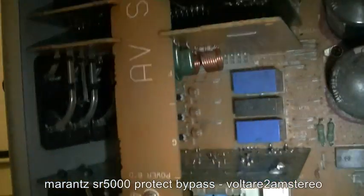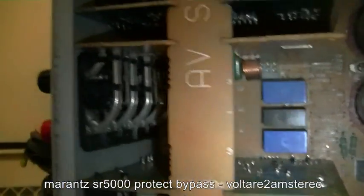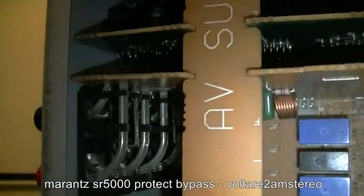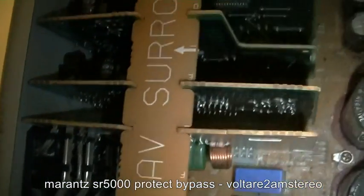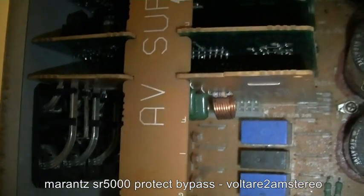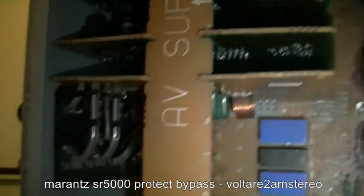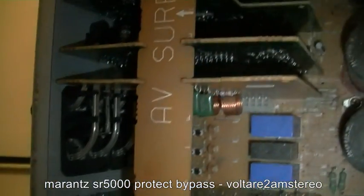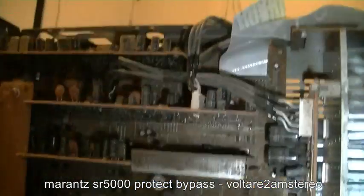Oddly enough, with this amplifier's design, the black terminals for all the speakers actually go straight to ground. They're not BTL'd off the back of a pair of amp chips or anything like that. It's being run basically, I think, you wouldn't call it single-ended, but it's referenced from ground up. It's really quite bizarre, but that's just how they've done it. Interesting board design.